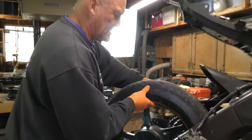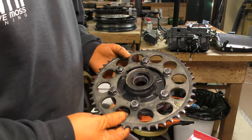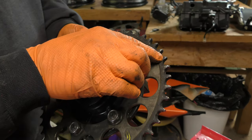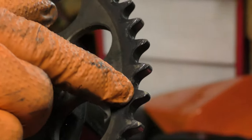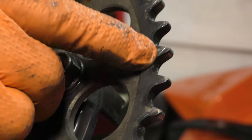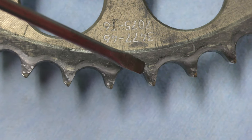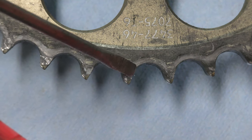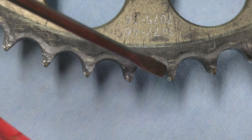As far as the wheel goes, that's fine too. But we have a problem: the teeth are all rounded out. The U between each tooth is exaggerated in shape — from one side to the other it's not even. You can see it's very short here, then it gets elongated and comes all the way back on this side — totally misshapen on the U between the two teeth.